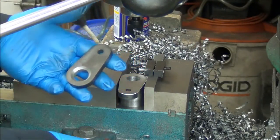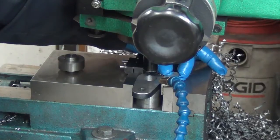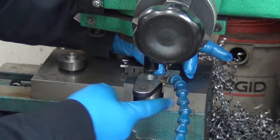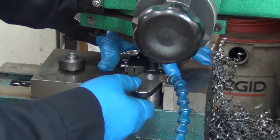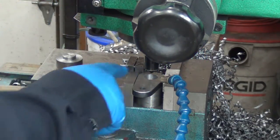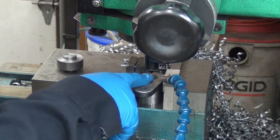I put a piece of aluminum over here on this side — you can see that — because putting this piece with the hard edges from the laser cutting up against the two hard jaws, when it wanted to start swiveling around it wouldn't really grab, and this would start wobbling. So that piece of aluminum helps get some extra bite there. I've also got a vice stop in there so I can put the piece in repeatably and clamp it down.